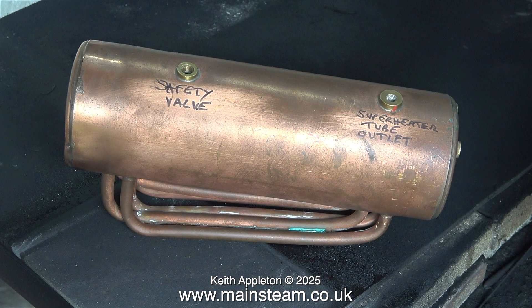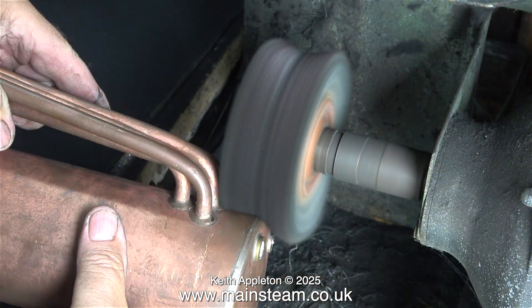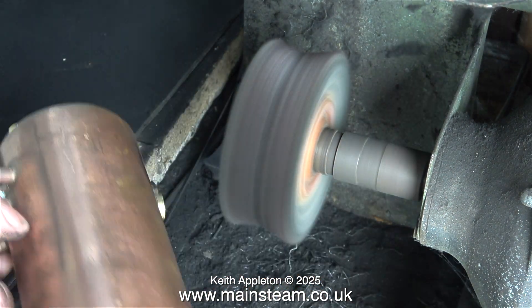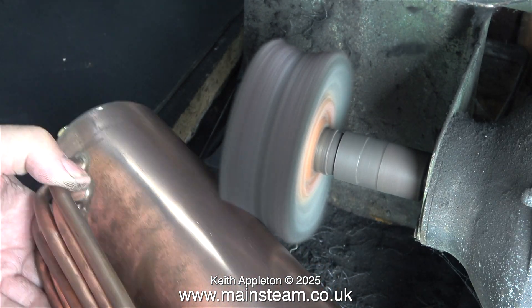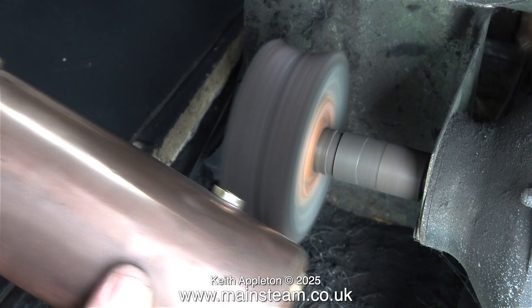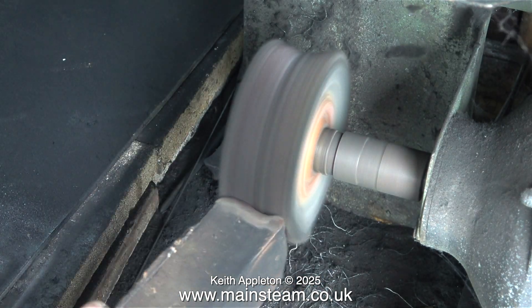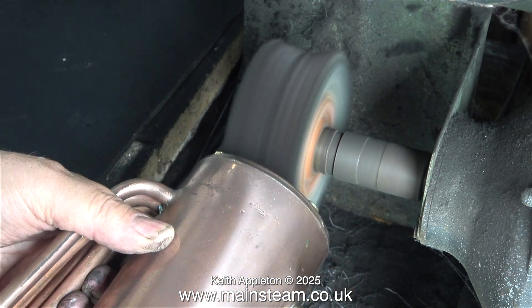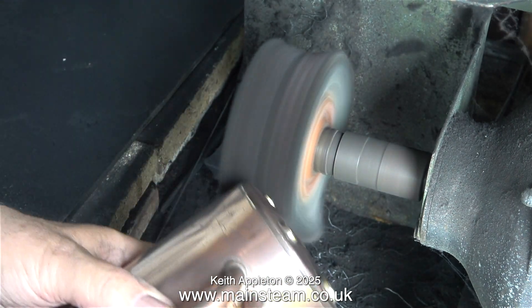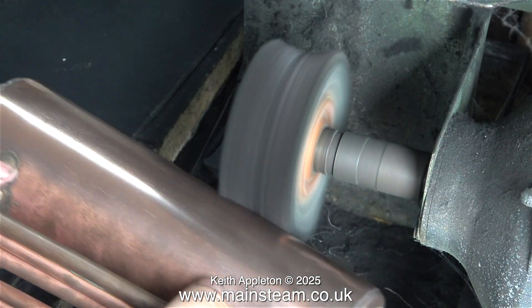With all the painted parts now in the inner part of the workshop with the door shut, I can clean up the boiler shell of the 504 boiler, and for this of course I'm using the polishing spindle. It's fitted with quite a soft polishing mop. I've just applied some abrasive wax to the wheel — it's very important to do this to make it cut — and as you can see it's removing the tarnish very quickly and leaving quite a good finish. You must really hang on to the part. If the wheel grabs it, it will snatch it out of your hands and possibly throw it across the workshop, and that's not a good idea. You will notice the frequent applications of the wax abrasive. This is quite a tricky job — there are lots of corners to get into, and if you miss any of them it will look terrible. It takes a long time; the video is currently running at 400%.